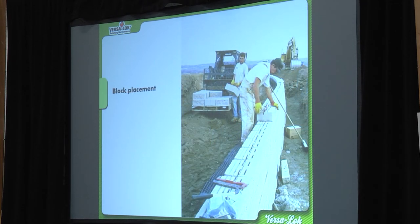This is the exact system I use — one skilled guy setting who knows exactly how I want those blocks set in, and a newer guy who's going to lift most of the blocks for the guy that knows what he's doing. Work smarter, not harder. I have a bobcat come along and a pallet of block. I'd like to see two pallets there because sometimes you get a little variation — one light gray will be a little lighter or darker than another. You don't want to see those color lines or blotches in your wall, so pick off at least two pallets if you can.